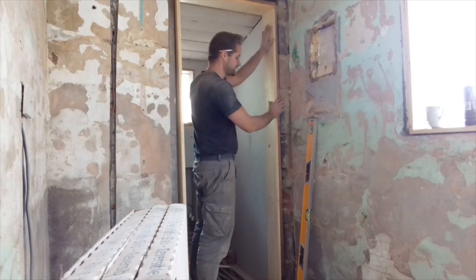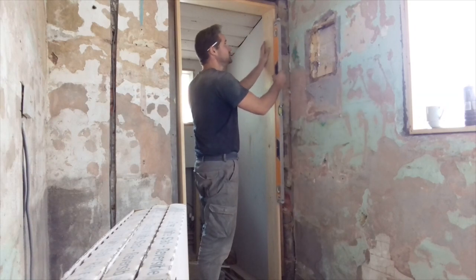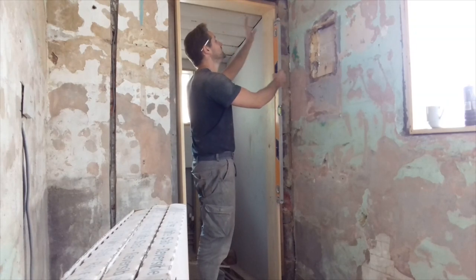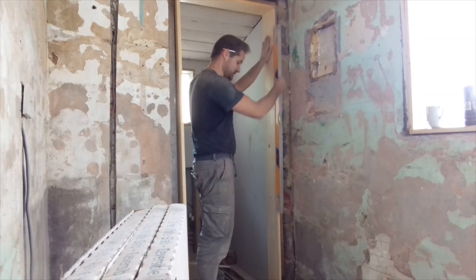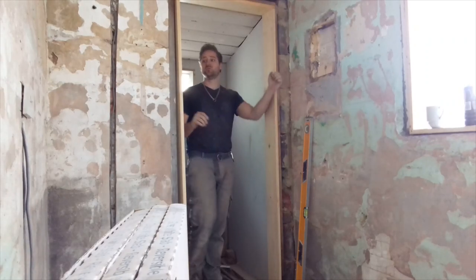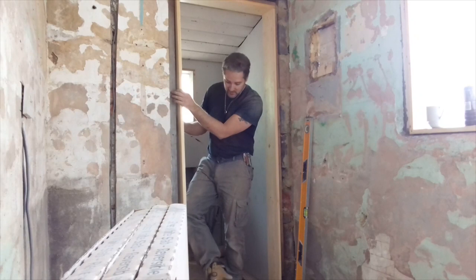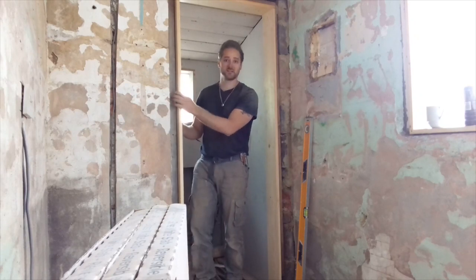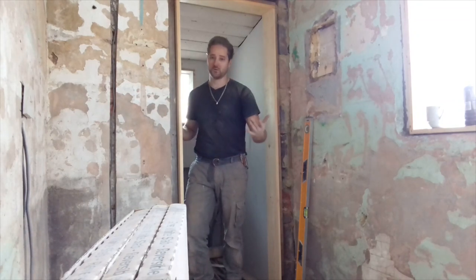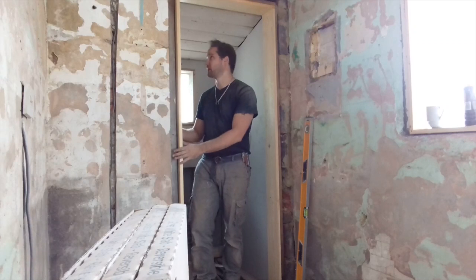So what you've got to do is fix your hinge side in place, knowing that that is level — you don't have to fix the top. You can do it if you really want to, but you don't have to. You've got to fix your hinge side first, then hinge the door. When you bring the door to the shutting position, you then adjust this side to suit. It saves a lot of aggro in the long run rather than trying to warp the door, which you're not going to do.